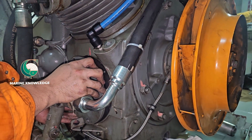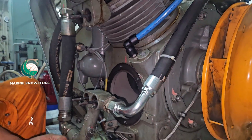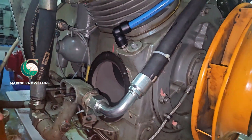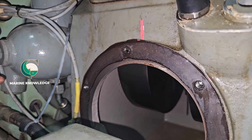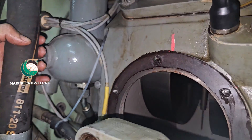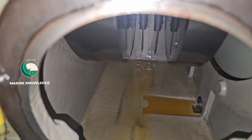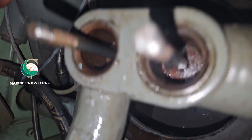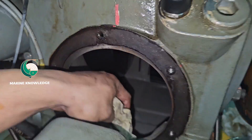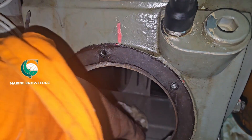In this case, we need to first check from where the water is coming. We cannot open the cooler or cooling water since the cooler is already out. We check the gasket condition of the sump cover — you can see the sump inside — and we don't find any leakages, actually no water supply there. So there is no point in checking further, and you clean the sump properly, making sure you are using lint-free rags for cleaning.